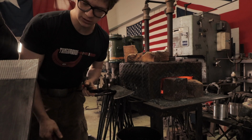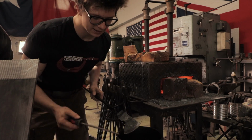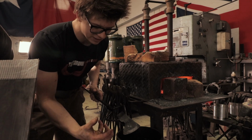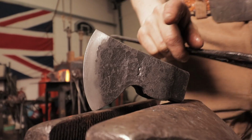which means that it's going to be able to be tempered back so that we make it less brittle. We can temper it back, get it to the perfect level of hardness. The balance between hardness and toughness is in a nice place for the particular tool and for the geometry of the tool. So we're now going to temper this.